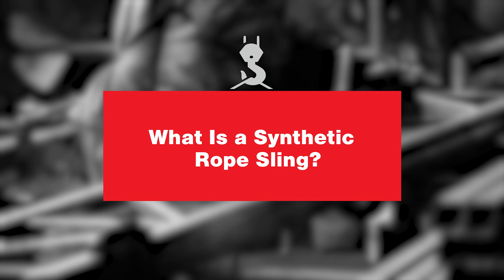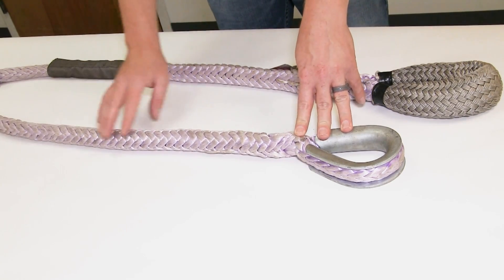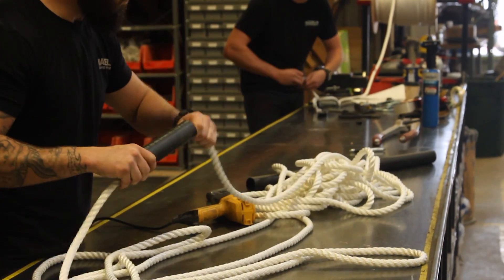There's a wide range of synthetic rope slings. What you want to do with synthetic rope slings is stick to the HMPE ropes — those are your plasmas, the Enduras, etc. You'll have a different configuration depending on the diameter. It'll be just like a stranded rope, but when you get higher in capacity and higher in diameter, think of those smaller diameter ropes interwoven to create a bigger diameter. They call it a 12 by 12 — basically instead of smaller yarns and strings making up the strand, think of the smaller ropes making up the complete rope itself for the larger diameters. As you get higher into capacities and diameters, the rope will change but still have the same characteristics.